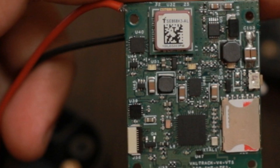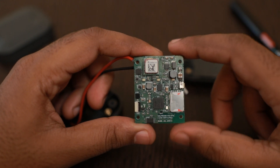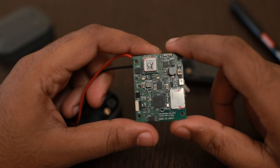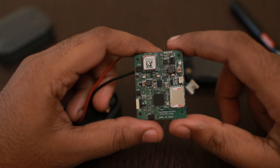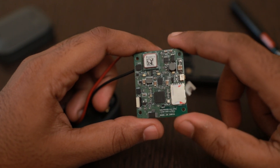This is the same GNSS module which was used on the Veltrack V4. This module has been giving good results compared to the SIMCOM versions, so we are also using the same thing here. Even though there is very little ground plane available and it's sitting in a crowded corner of the board, it still gives very good reception and is able to acquire GPS sync within 30 seconds.